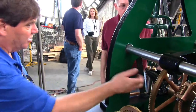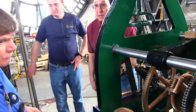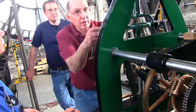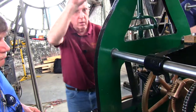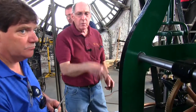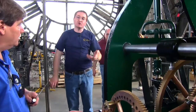This would be your minus or plus an hour for daylight saving time — each one of those turns is a minute. You can do it that way, or you can stop the clock, or crank until one hour — 60 turns. Some people lift up the escapement; I don't recommend doing this too often until you get the feel of it, but lift up the two arms and the third person lets it freewheel and that will advance it pretty quickly. Just be careful, study it — it's okay to do the escapement arm thing, but you have to be careful because the escape wheel gets going fast and if you drop those arms back in there, you could damage something.